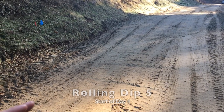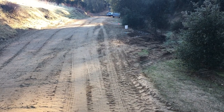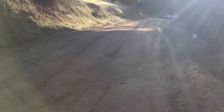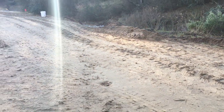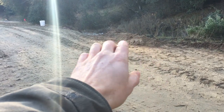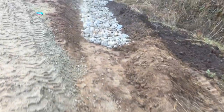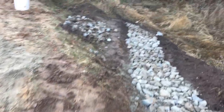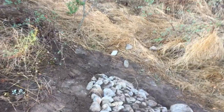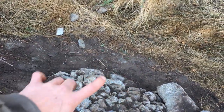Here we are looking at Rolling Dip 5 — the water course comes in here and crosses the roadway at about a four percent grade. We'll check out the stone-lined rundown that Riley's almost done constructing, with a little bit more work needed for feathering the rollout on the downhill side. At the bottom low point, water heads this way with a catcher's wing coming out, all lined with gabion rock on the side. The gabion comes up right toward where the grade steepens heading into the drainage, and at the bottom Riley is going to be putting in a tips-up medialuna — a tiny little deposition basin to collect any sediment that reaches the bottom, creating a wide arc with a very level sill for water to discharge over the broadest surface possible before transitioning back into the waterway.